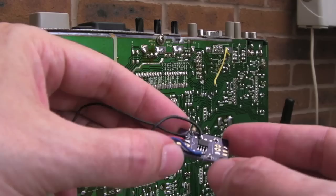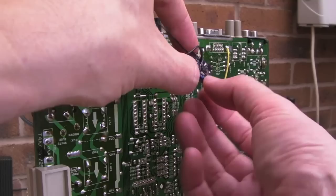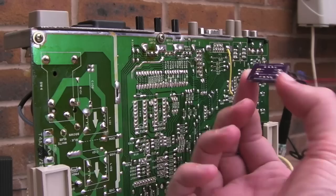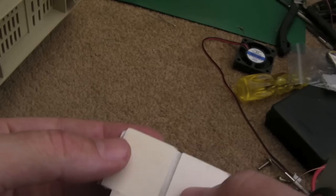I've cleaned up my little board - got rid of all the flux, brushed it down, it's looking pretty clean, and removed as much solder from one side and put all the wires on the other side. There's a nice space available. I'll get a double-sided pad, stick the board off the main board like that, and it'll be firmly stuck down - there's nothing on the underside that would interfere. Then I can just join my wires up to the destinations, no worries.